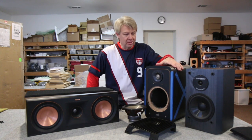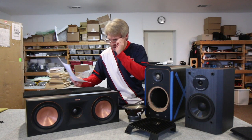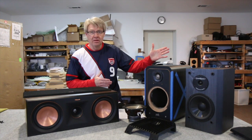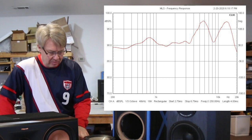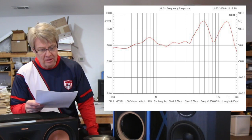Now let's get down to business. These are speakers that have shown up for measuring, testing, and hopefully some upgrades. Let's start with the little BIC speaker on the end — it's the BIC model DV62SI that a customer sent in. I'll slide over to give a little room to post measurements as I talk. Looking at the frequency response, you'll see a couple of big peaks at the top of its frequency range, right around 15kHz and somewhere around 6–7kHz.